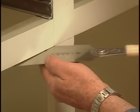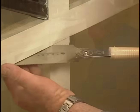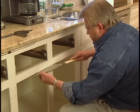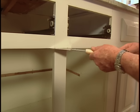While I secure it from the inside with screws. With the reinforcing strip in place, I can now cut away the vertical face frame sections using a Japanese hand saw. I want to try and save these since I may be able to reuse them later on.